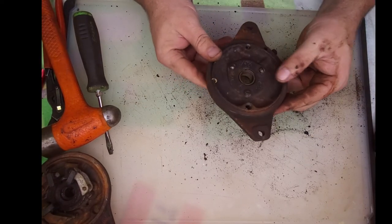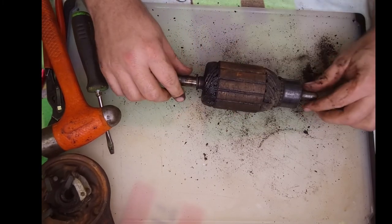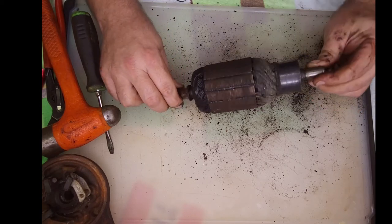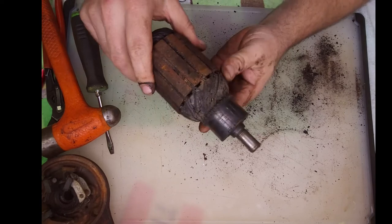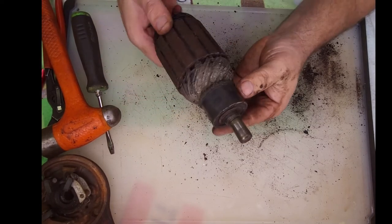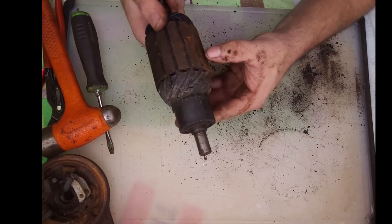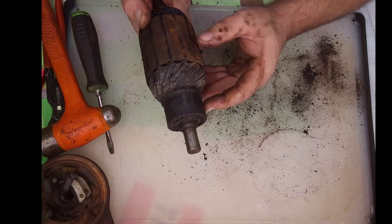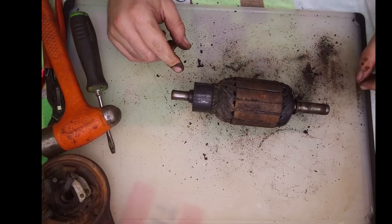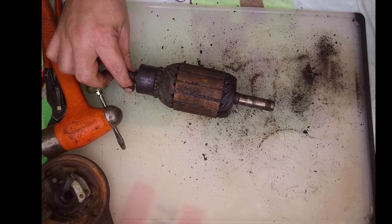The bearing is shot - kind of expected that. It's easy to replace on this armature. Look at how burnt up that is - you can't see any copper there, it is black. Looks like they're all making contact with each other, probably shorted to ground too. There's another washer you'd need to make sure is in place when assembling.